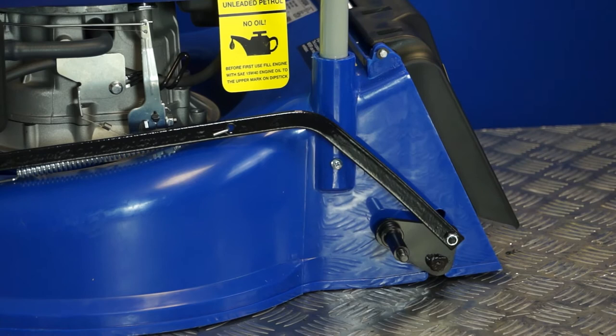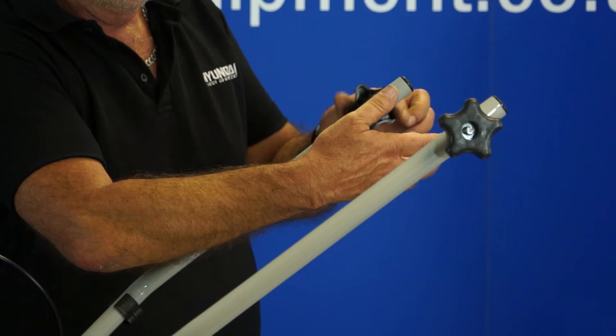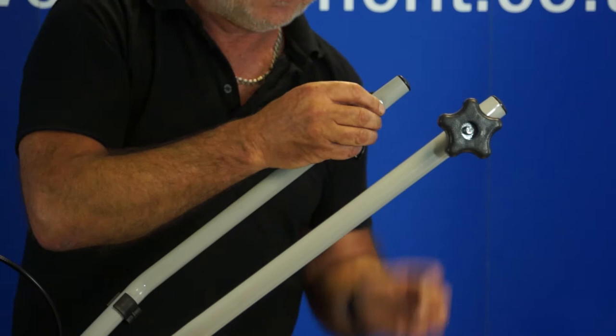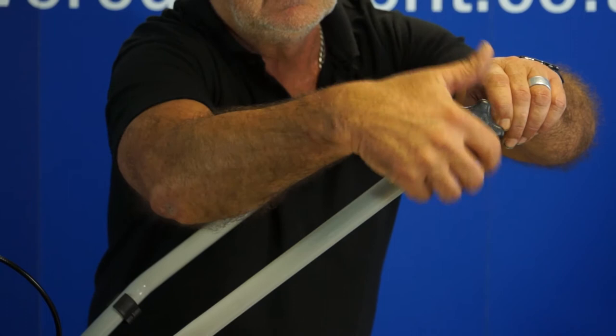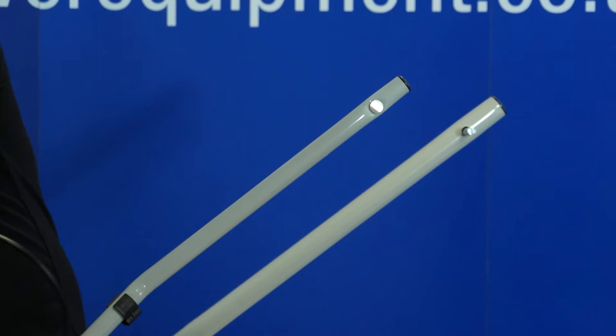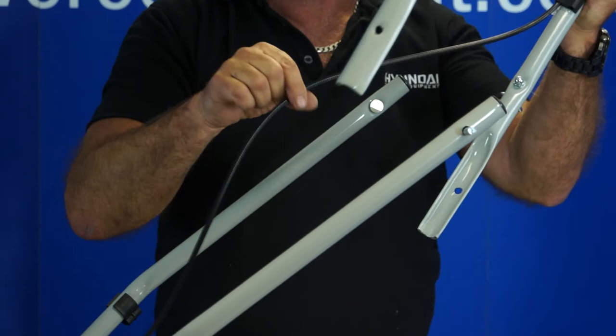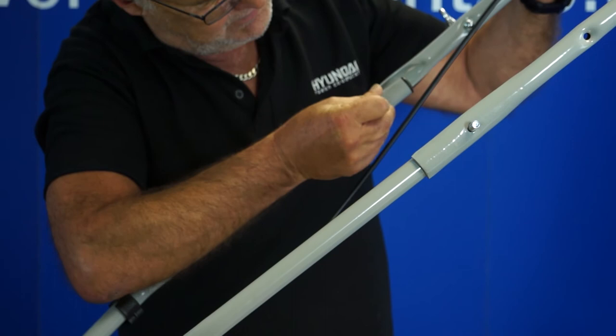I'll just start the screw and not tighten it at this stage. Having fitted the lower handles and left the screw slightly loose, which allows a little bit of wriggle room, I'll remove the fittings from the top of the handle. On this side — the far side — it consists of a nut, a pigtail, a plastic washer and a bolt. I'll just leave the bolt there for the moment, and exactly the same on this side: a little hand wheel, a little washer and the bolt — we'll just leave it loosely. My next stage is to take the upper handle and, carefully taking care not to trap the control cable, just feed it over that bolt, taking care of this cable all the time, then spring the frame out and fit the bolt on this side as well.